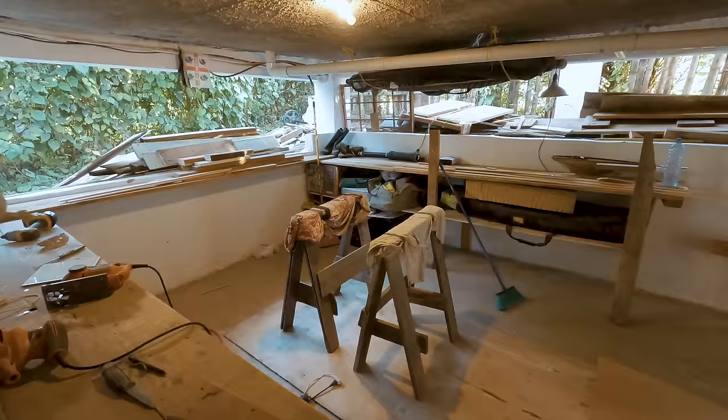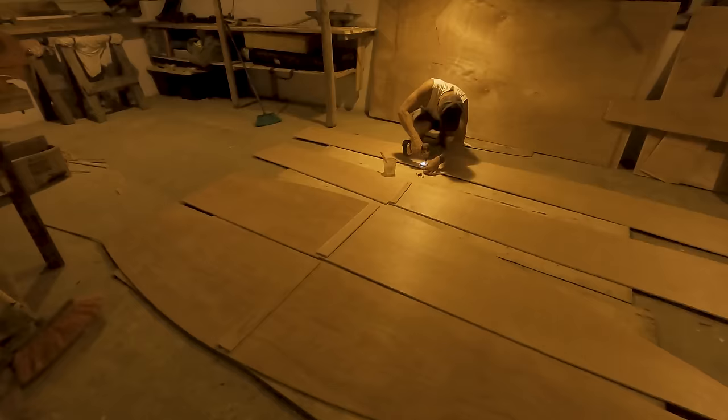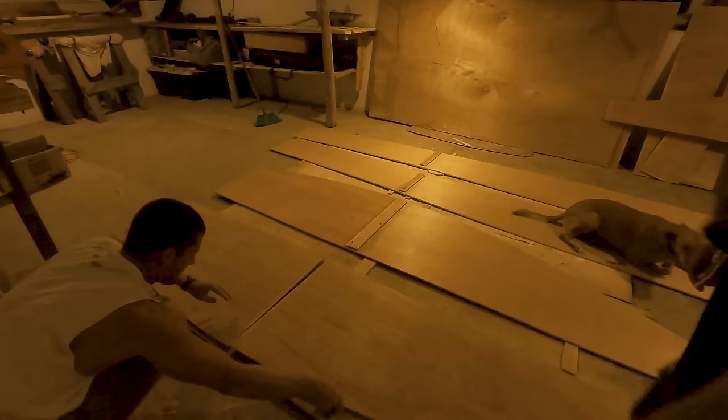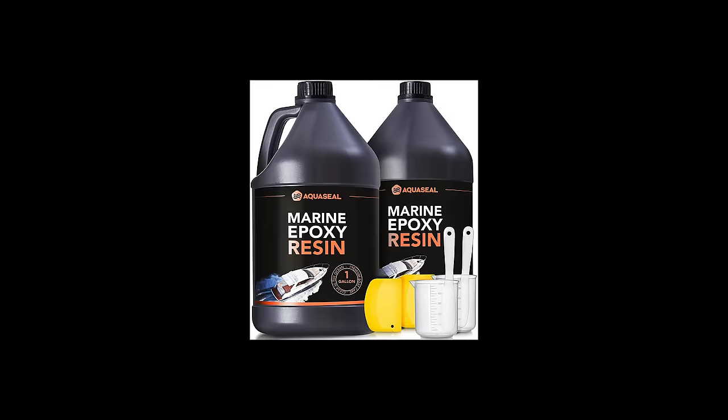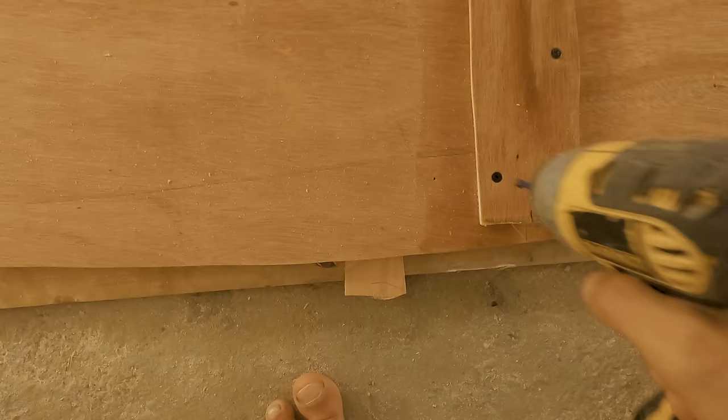Since the plywood sheets are shorter than the length of the boat, each longitudinal panel had to be traced in two parts. I used plywood butt blocks and glued the parts together using epoxy. It's the easiest way to do it, but it's not recommended by experienced boat builders, because it's a little bit weaker and it can create a flat spot in your curve. I bought the epoxy resin on Amazon — it was the best deal I could find and the epoxy is pretty good quality. For most of the build, I used short wood screws to hold the plywood in place; they can be removed once the epoxy cures.